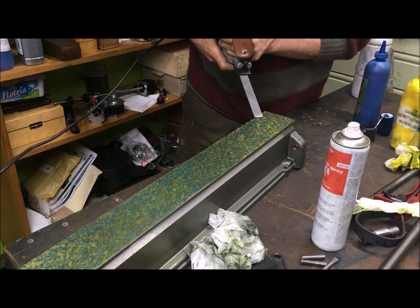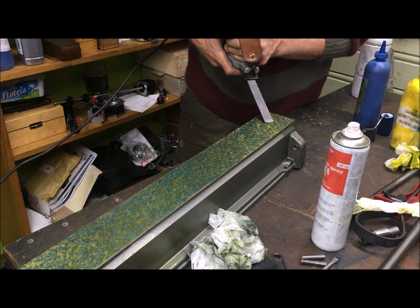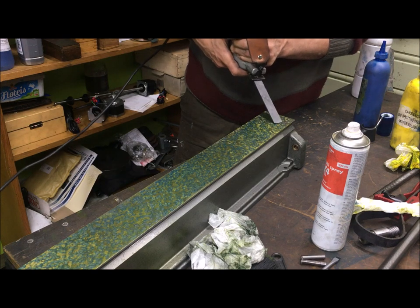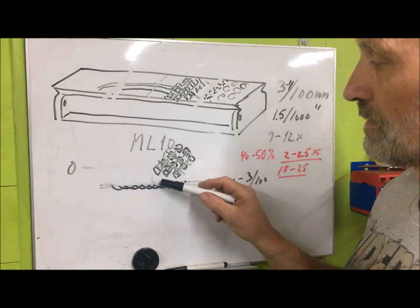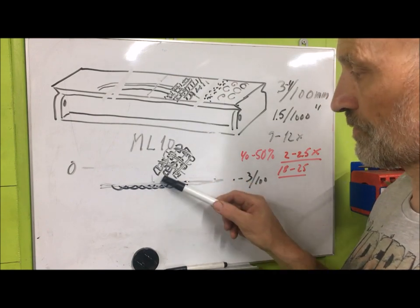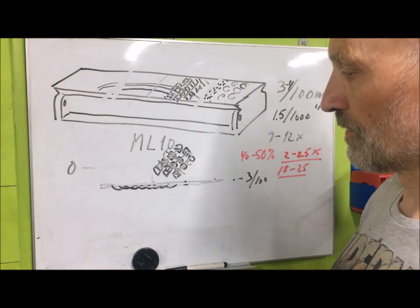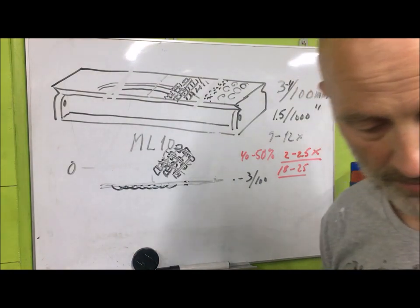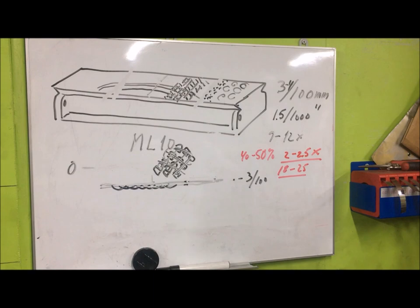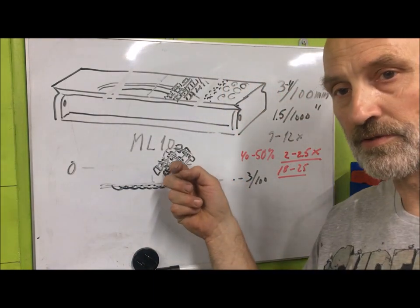Just picking the blue spots. Not trying to take them all away, but cutting them in two. You'll end up with the pattern, and the depth of cut will give you then the needed oil retention capacities. And longevity, meaning that the parts can hold.